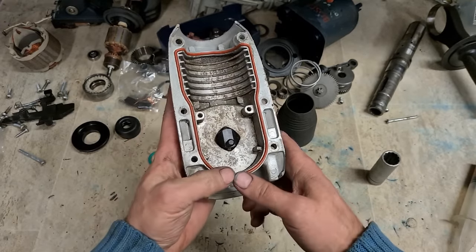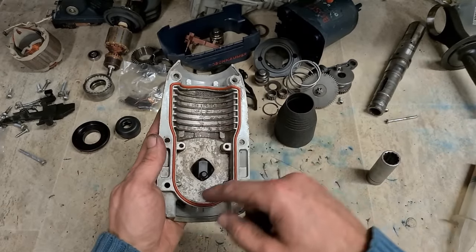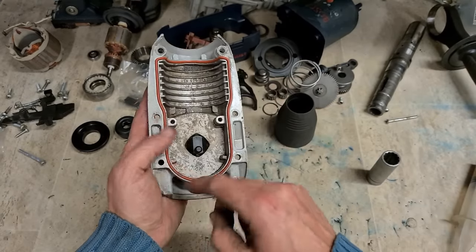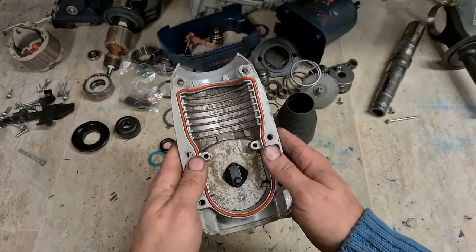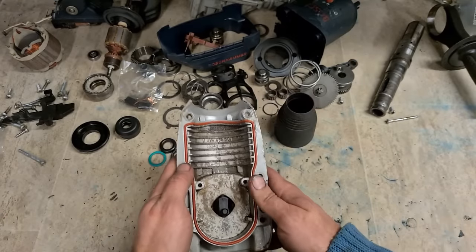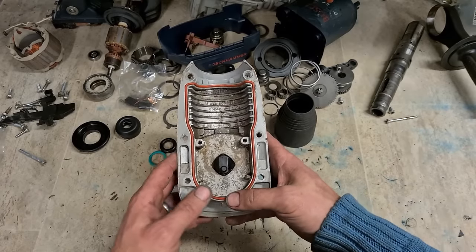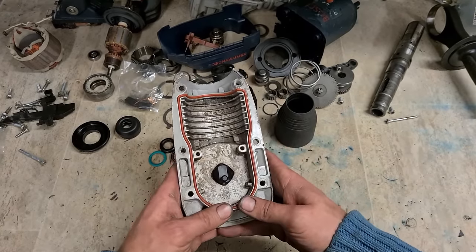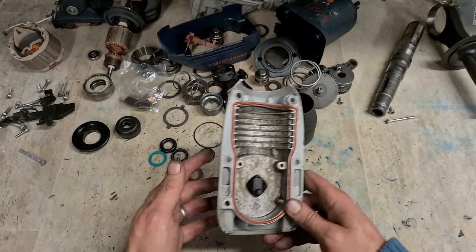Don't pull out that seal. Once you pull it out, it'll actually stretch a wee bit and expand. That will not go on properly. It'll kink every time you try to put it back in, because it'll have gotten longer. That kink will cause an oil leak. Price of that thing is €11. So if you're also changing these O-rings plus this, you're nearly better off buying a full service kit. It's nice and cheap just to replace them two on their own. But if you don't need to take this out, leave it alone.